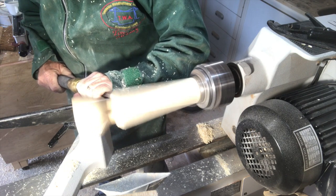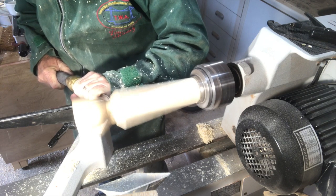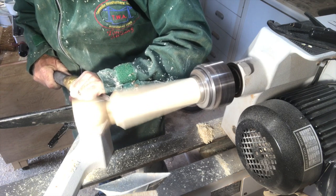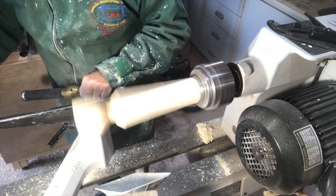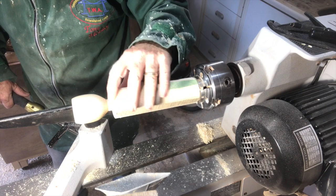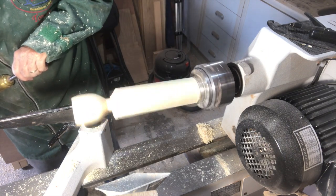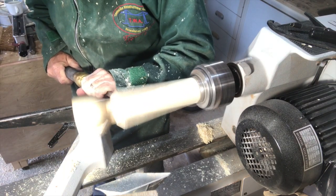You try to rub the bevel once you've got the angle that you're going in at, probably a 45-degree angle, and as you can see, I'm with the chisel, I'm just taking it off as slowly and as positively as possible, and keep stopping the lathe, inspecting what you've done, and then I'll let this run at normal speed to get the first part of the wobble for it.